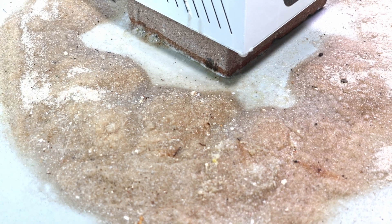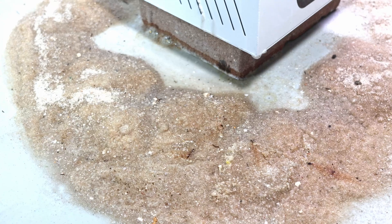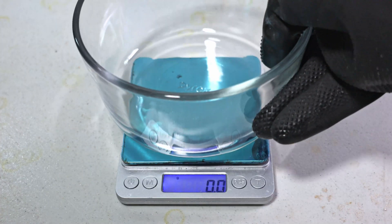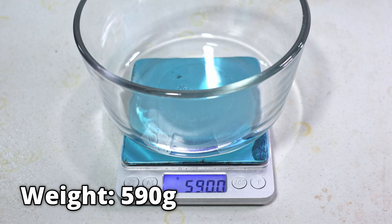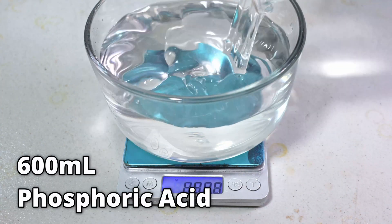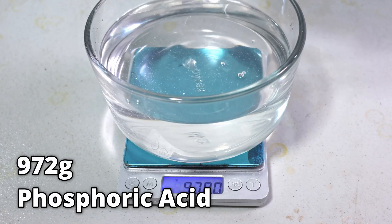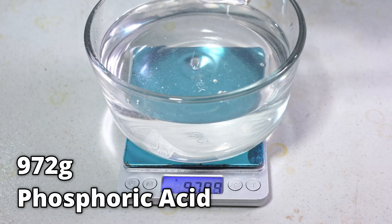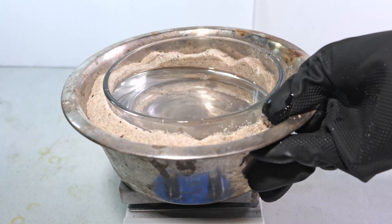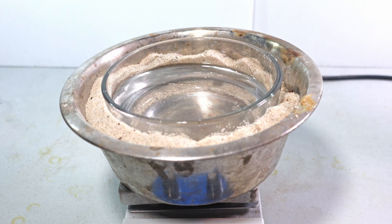Around the base, I had to put down some sand to limit the spread of the phosphoric acid, but ideally you should use kitty litter if this happens because it is designed to be absorbent. This time, I weigh a 1-quart Pyrex glass — it is right at 590 grams. When filled with 600 milliliters of phosphoric acid, the weight of only the acid is 972 grams. I'm using less simply because this is how much phosphoric acid I have left. Next, I place the Pyrex crucible on my old trusty hotplate and insulate it with sand to allow even heating.